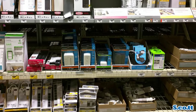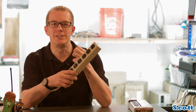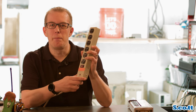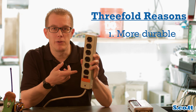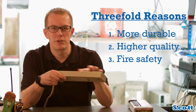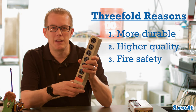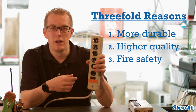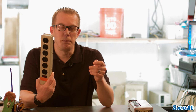I went to Home Depot, as I sometimes do, to buy a power strip. And when I got there, there was plenty of choices, but most of them were shitty cheap plastic power strips. What I wanted was a metal power strip — something like this. Metal. The reason I like a metal power strip is threefold: one, it's more durable than a cheap shitty plastic power strip; two, because it's a little more expensive, it's usually a little better made; and three, if there's some kind of electrical fault inside this thing, instead of melting and burning like plastic does, the metal will just get hot and hopefully short out and trip the breaker. So it's a lot safer. My advice — spend a couple extra bucks and get a metal power strip.